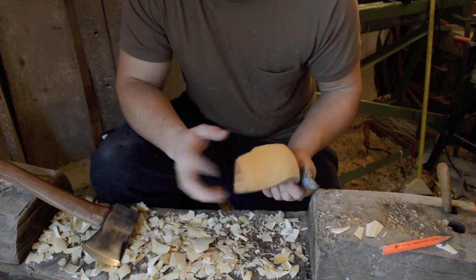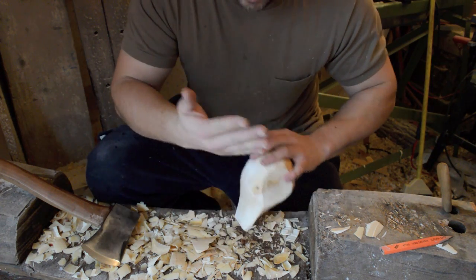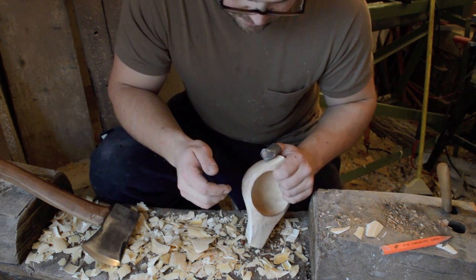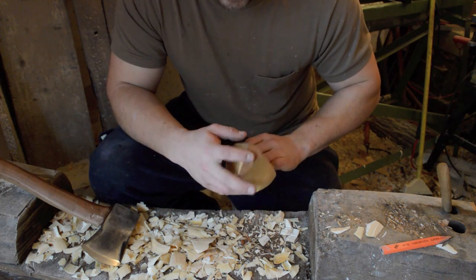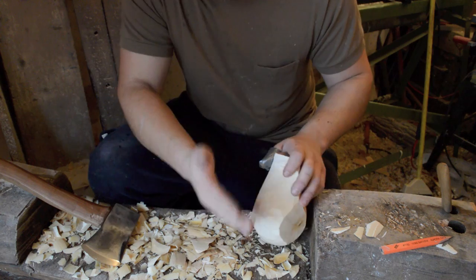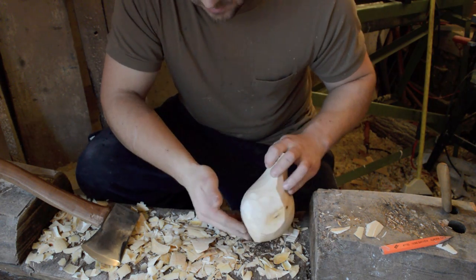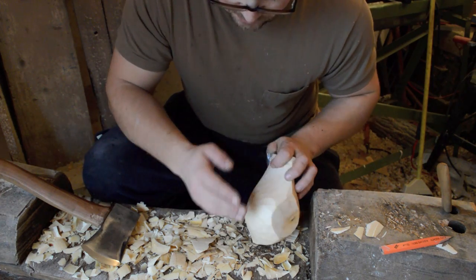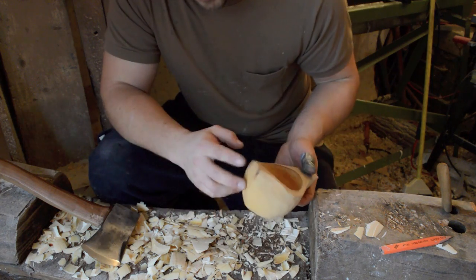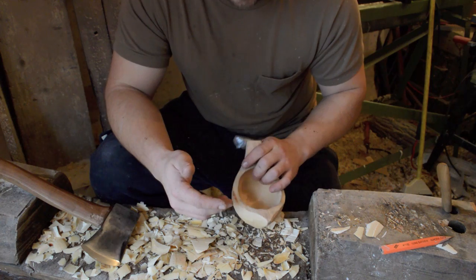So what I like to do is get the back handles. I take off a corner, corner, corner, and a corner, and I like to leave a little bit of the blunt end just to take a bit of a beating. Another functional purpose of this point is, as I do the same method, taking off a corner around the top profile and then tracing around. I did have a circle there, so I take a corner with the axe off, and then another corner profile, and this point lets the kuksa take more of a beating.